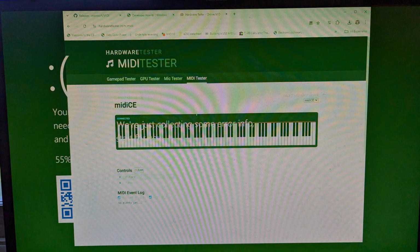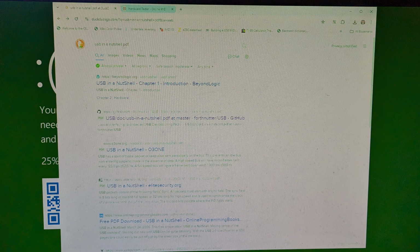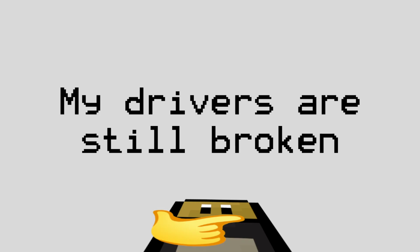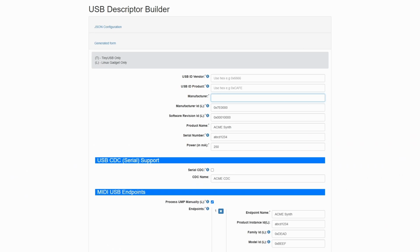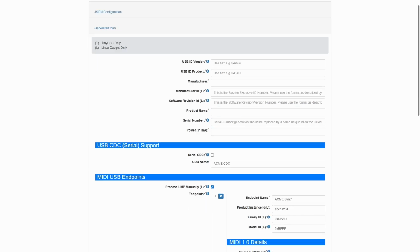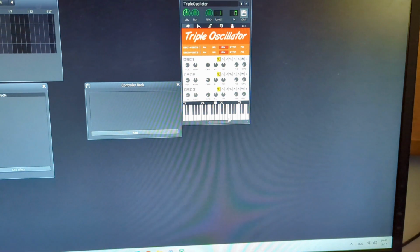However, when I gave the program a second try on Windows, I ended up actually causing not the calculator, but my computer to crash. After significantly more crashes, research, and somehow breaking my Windows audio drivers multiple times, I found this website which I used to create a new descriptor. It was super helpful and definitely what I should have done from the very beginning. I had to make some tweaks since the site generates a descriptor for MIDI 2 but the program uses MIDI 1, but after that, the new descriptor fixed the crashing issue.